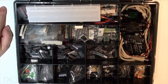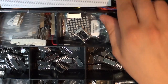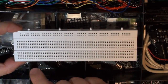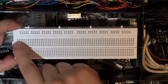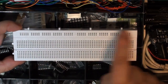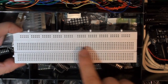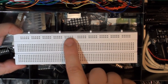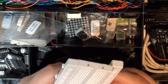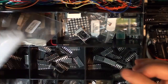The kit is made up of many different components. We have our connection components in the top corner. Here you can see the breadboard, which is made up of rows and columns. Each column is connected together with a break in the centre line. The rows can be used to set up your plus and minus voltage rails. The gap in the middle breaks the connection, so make sure you bridge it. There's also a separate piece that can be connected in on either side and will just slot into the side.